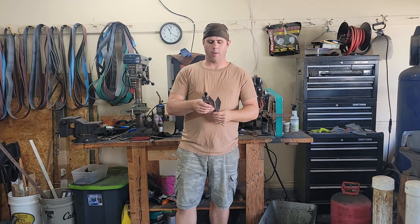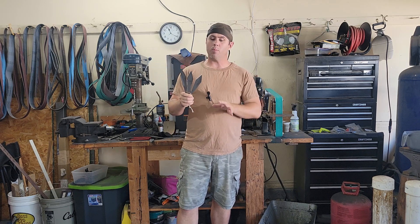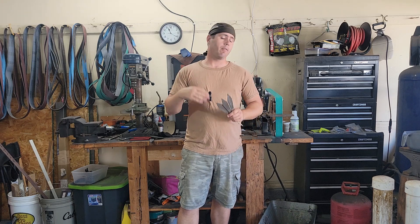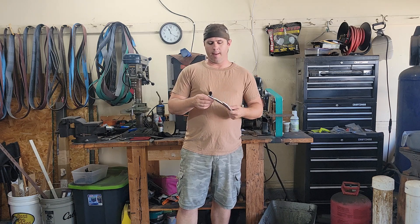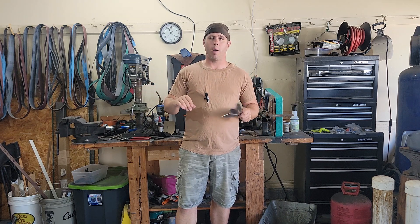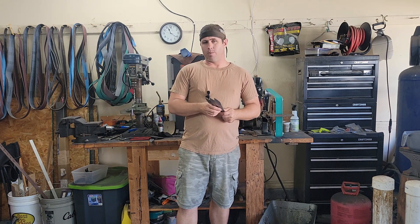Alright, so we've got our knives here, pretty much cut to shape and ground down and ready to go. The next step is hardening and tempering the throwing knives. Now there are several schools of thought on this. The first is you don't harden them at all — you just get them to shape, grind in the bevels a little bit, and throw them. The reason is that if they're hardened and not tempered properly, they can shatter and break. Also, if the knife hits wood and doesn't stick, it can bounce back pretty hard because it's got more springiness to it.